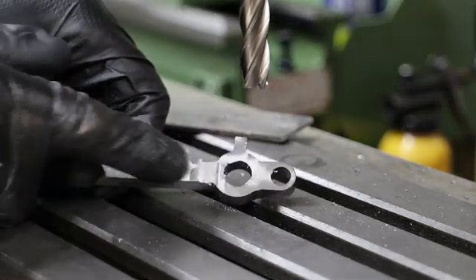As before, I still need to reposition one of the clamps so that I can get to this end of the rod. I don't have to touch off this time because I reset the DRO to zero on the final cut for the main body. The downside with this approach is that I don't get the nice radius at the end, but that's easily fixed by using the round nose end mill. I touch off against the finished face and then take multiple small cuts. As is normally the case for me with these cosmetic features, I am doing this by eye, working to a scribe line on top of the rod.